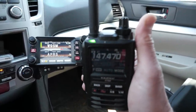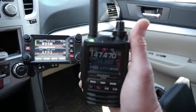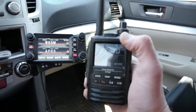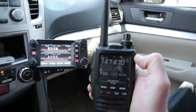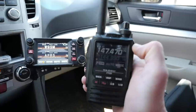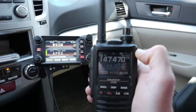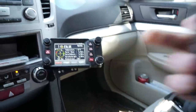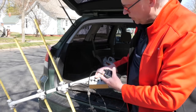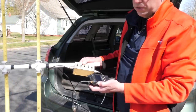This is KD9CJX — the box has been engaged. With the handheld radio and just the little whip antenna, it is really a weak signal. We're going to wait for the next transmission to see if we can get a reading with the Yagi antenna. I have the handheld radio tuned to our simplex frequency, the attenuator in line with all switches set to the off position, and we're connected to the Yagi antenna. The fox will transmit every minute or so — and there she goes now.